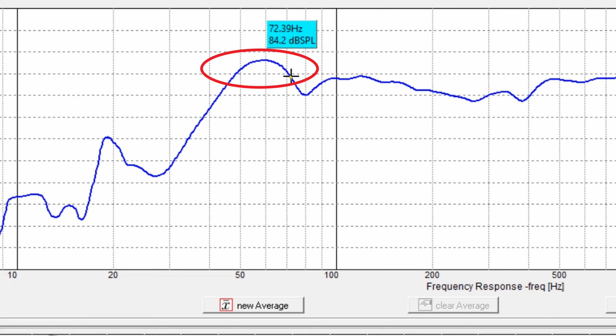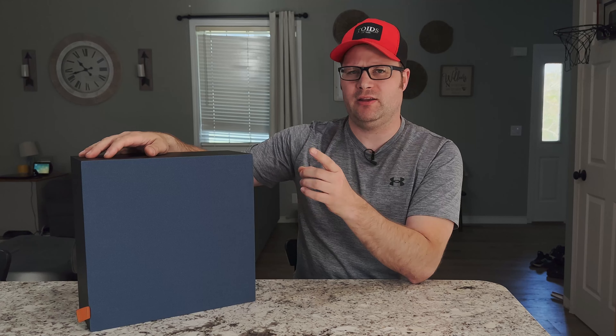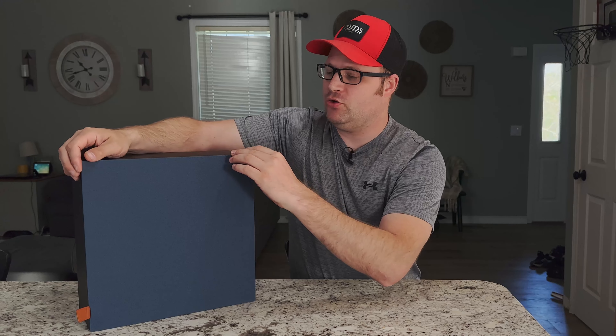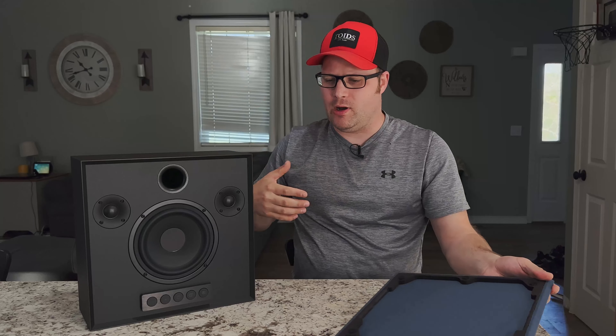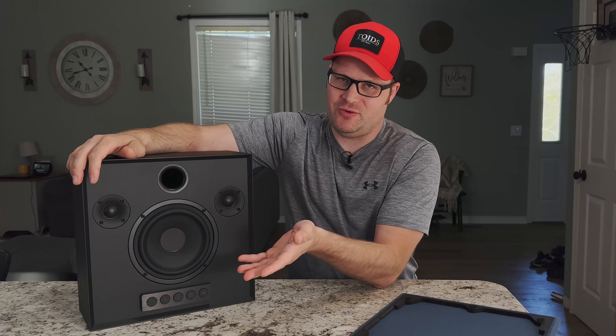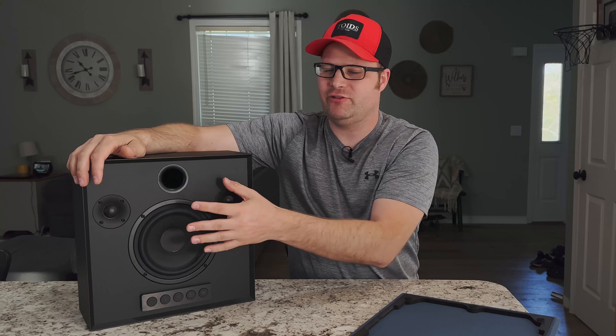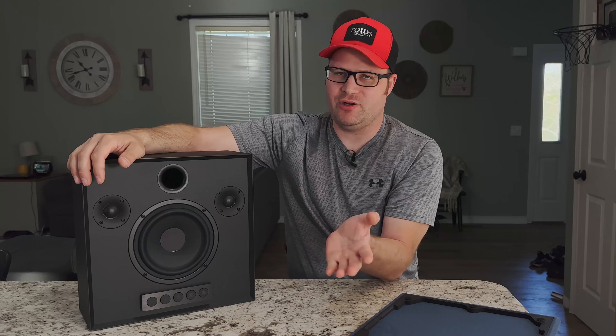We did have a little bit of a hump in the bass region — about two decibels up. I don't actually mind that, because when you're listening to music in just that small range, it's actually nice to have that, especially when you're listening to something like a pop song or a hip hop song. It made this come up with a little bit more bass than it typically would have. They didn't do any off-axis response measurements, and there's a reason why — a Bluetooth speaker in general is never going to do well off-axis because they have two tweeters and often two mid-ranges so close together that you're going to get lobing and comb filtering when you go off to the side.